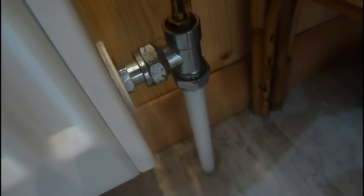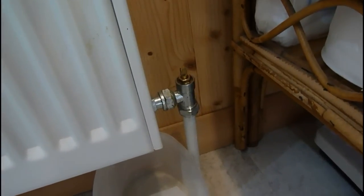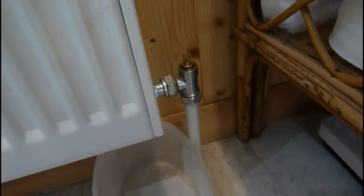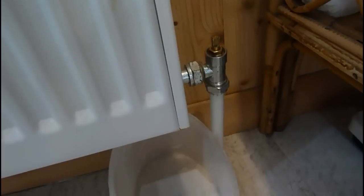In my instance I've got a little tiny spanner here that will do the job and we just screw them right off. Now they're both off on that radiator. Next, a little container to put under there because there will be a little bit of water - it's unavoidable. If you've got carpets, get plenty of old towels and put them all around the pipework because there will unavoidably be a little bit of water. We can't avoid that.